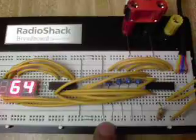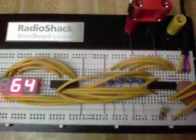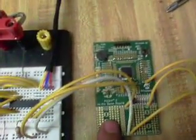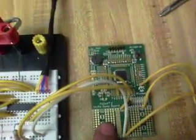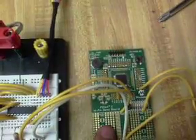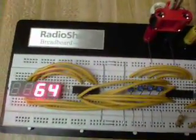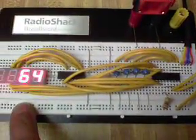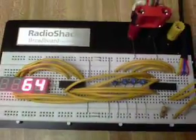The display controller has its own PIC microcontroller that drives it. And then over here, we have a PIC 16F887 40-pin PIC, which sends the data value via serial to the display, while this PIC 16F628A handles driving the display and processing the values that get received from the main brain to the display.